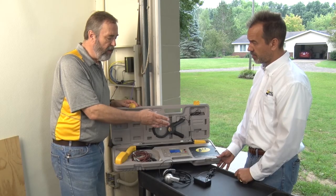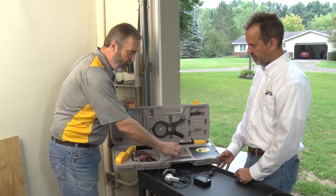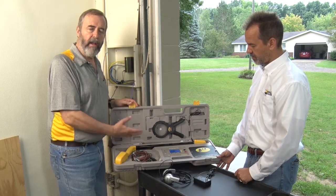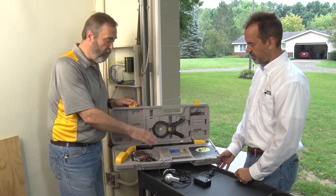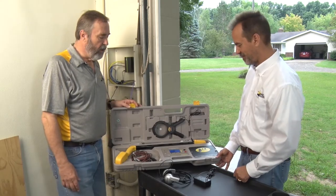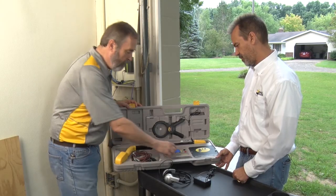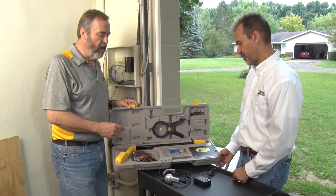This is not a recharger — it's an AC adapter. If you use rechargeable D cells, lithium-ion, or another technique, you charge them elsewhere and then put them in here, but you need to change this setting. You can also change the contrast on the screen — useful if you're working outside on a gray day or a very bright day. We're from Arizona and have a lot of issues with bright sunlight and LCD displays. There's also a backlight setting; depending on how often you work in low light, you can control it.